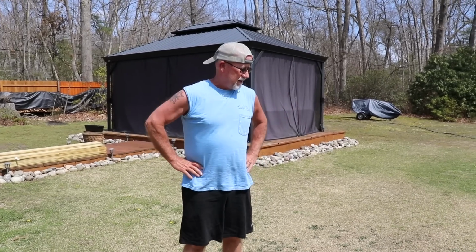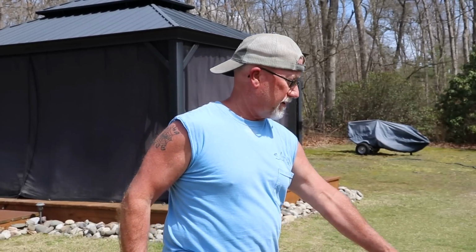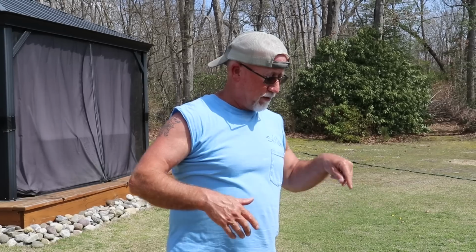That makes sense, because then you would have to worry about accidentally staining the other pieces, which we said we don't want to do. Yeah, and the 4x4 posts that are going to go into the ground, which the bar is going to get attached to, and the roof, I'm going to actually dig down and put them about 1 foot in the ground and tie it into this. So that's smart. A little bit extra, because I only want it 7 foot high. I don't need it 8 foot high.